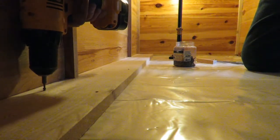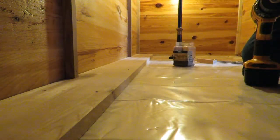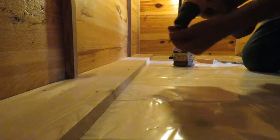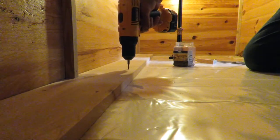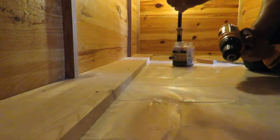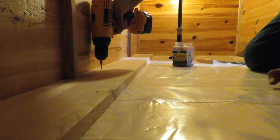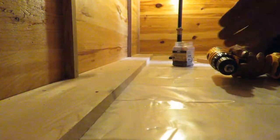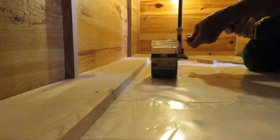The reason I'm using raw cedar rather than finished flooring is because I want the cedar aroma, and I need the cedar in here for tobacco beetles — it has a natural deterrent to tobacco beetles and the aroma is wonderful. On the next board I'll come in at the middle at six inches, then a foot and a foot, alternating the pattern because I want it to look nice.